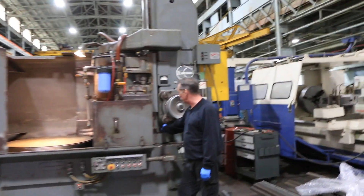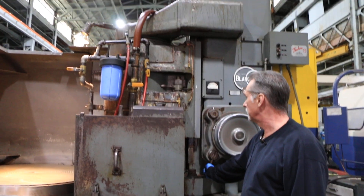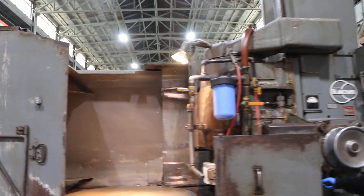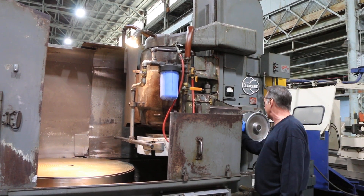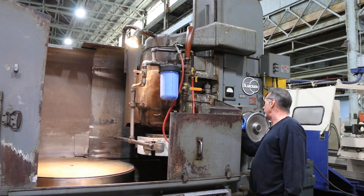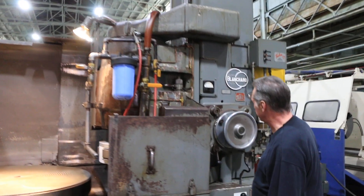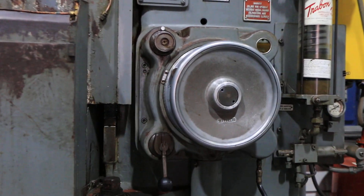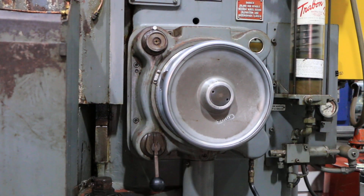Power up. Power down, of course. And you also have your automatic downfeed. I'm going to demonstrate this now before we start the spindle up so you can actually hear it. Set it for just a few thousandths, pull the lever, and it's feeding down — because the chuck's running even though the spindle isn't running, it doesn't make a difference. If your feed down works, it will feed to zero and then it will shut itself off. Like so.